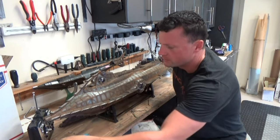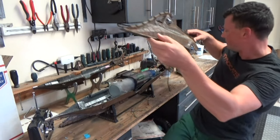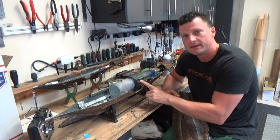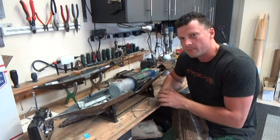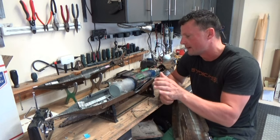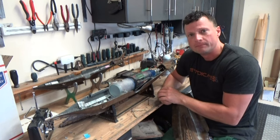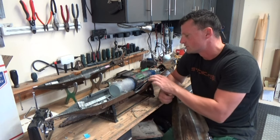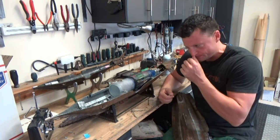The other thing that you're going to want to do is obviously break back into the model, and you're going to check it to make sure that there's no condensation inside the watertight cylinder. It's fairly common to get a drip in there and you'll see condensation. You want to pull that cylinder right out, check for water in the bottom. If so, immediately open it up, dry it out, and you can go through the testing procedure by putting the cylinder in the water, blowing into the tube, looking for bubbles.